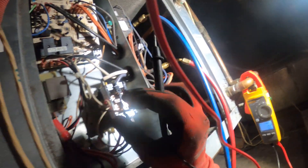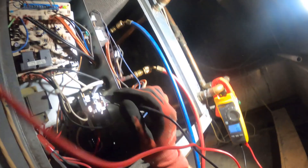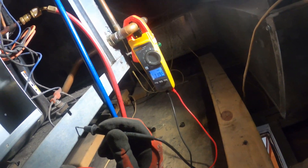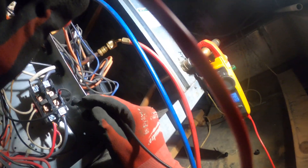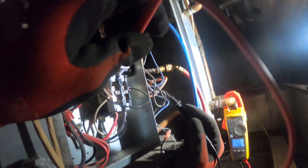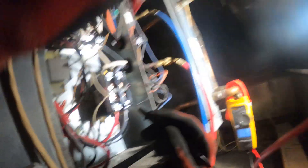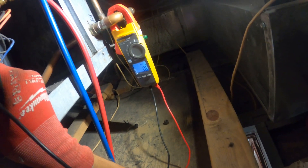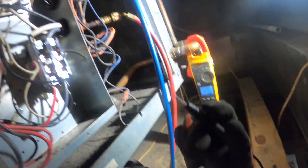The thermostat sends the signal to the board, and now the board has to send out voltage to tell our compressor to start. This contact is what starts it. This wire is one side of the coil — it says compressor — and we have 120 volts there. Checking one side of the coil to ground: 120 volts. The other side of the coil to ground: also 120 volts. It's a 208-volt coil, so between the two we should have 208, but we have zero volts.